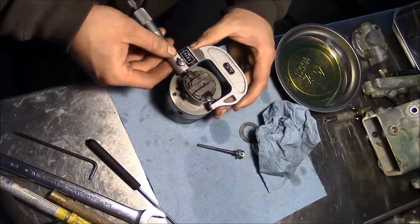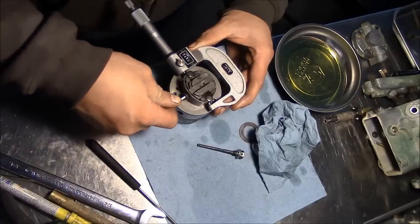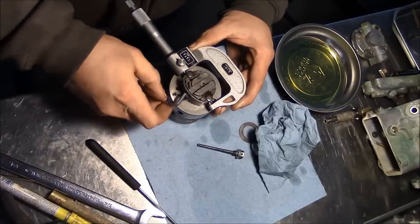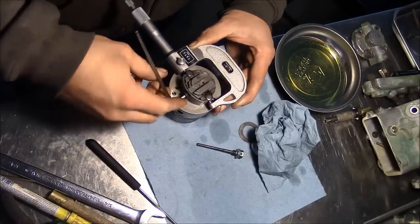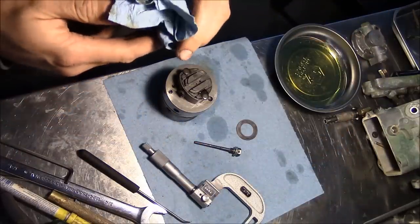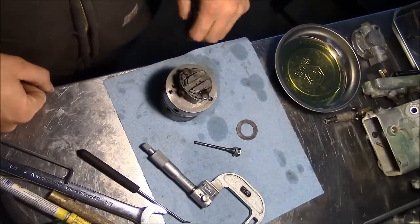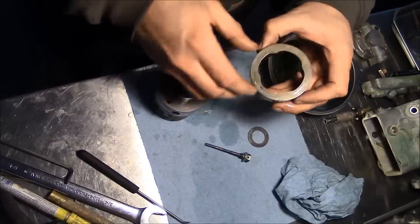Okay, we're supposed to set the maximum travel of these rollers by tightening this leaf spring. And there's a spec. The tighter you tighten this, the more it spreads and the more it allows these rollers to come apart. Okay, that's within 1/1000th. I think that's close enough. I did put a little bit more of the blue Loctite on this screw before I installed it, so I think we're gonna be good. Cross our fingers.